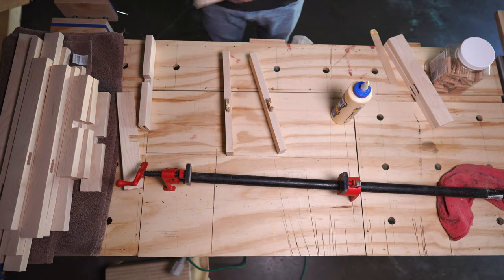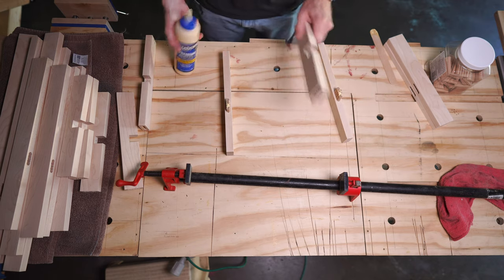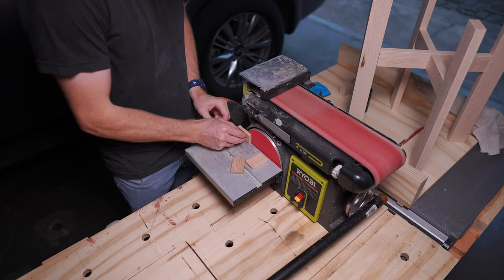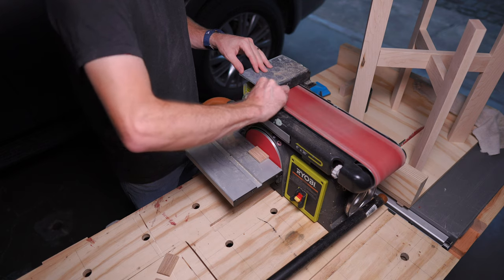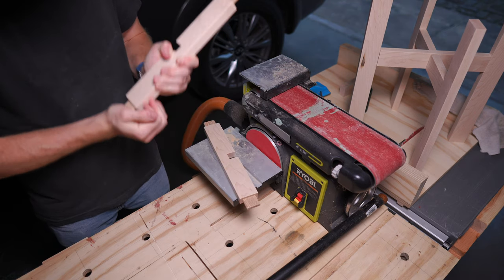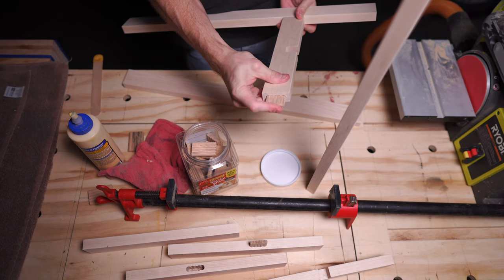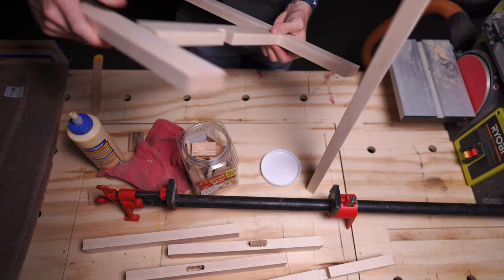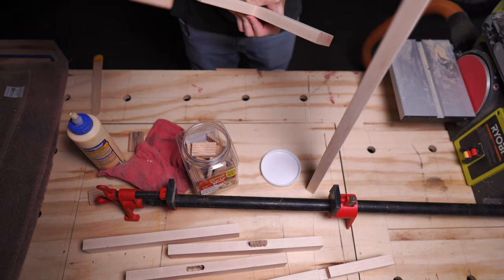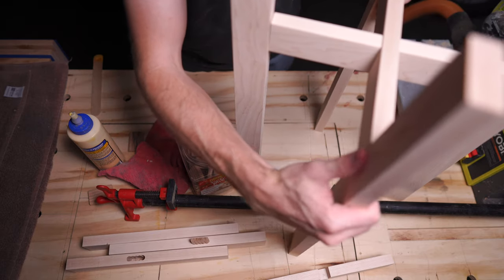First, I needed to figure out a better way to proceed before assembling the rest. I found that sanding down the tenon stock worked pretty well. Once they were thinner, I could fit them together easier, and for the crooked ones, if I sanded down the tenon a little extra, they had enough wiggle where I could straighten them out and then use a generous amount of glue to fill the gaps inside between the mortise and the tenon stock. Not ideal, but it'll work to save my planters.